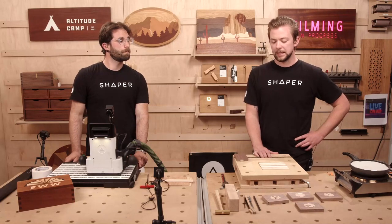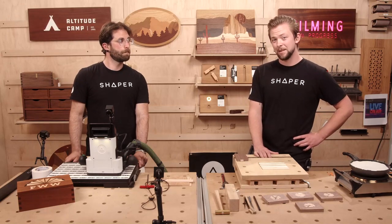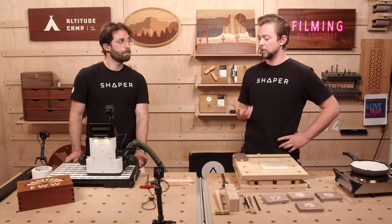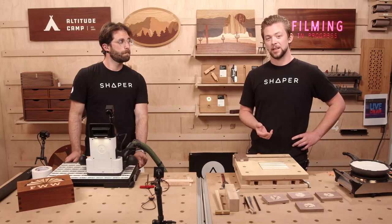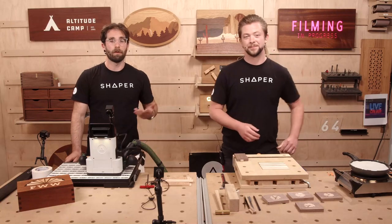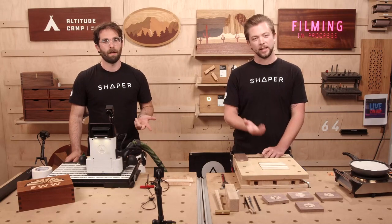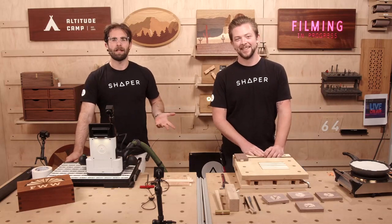There are a lot of different ways to get a burned texture — there's a heat gun, there's a torch. But the nice thing about sand shading is it's consistent throughout. It actually changes the color to the core of your piece, so there's a little bit of room for shaping after the fact. The other cool thing about sand shading is you can probably do it with things you already own. All that we used today is a hot plate, an unused old Teflon pan, and a bag of fine sand, which you can find at almost any hobby or craft store.